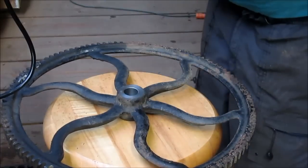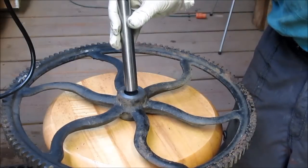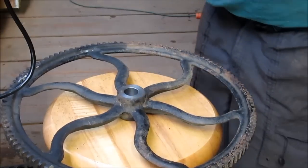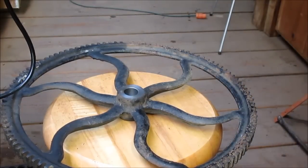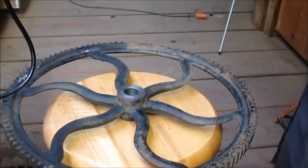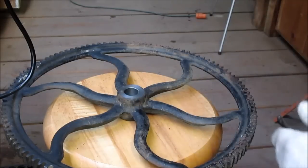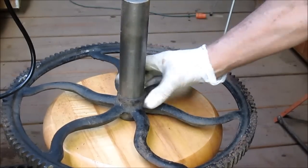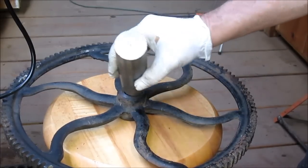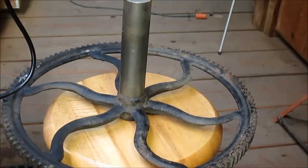Okay, we've got our surface cut. We've got our hole cut. And my one piece of tool stock is a little too small. Oh, well. But I always like to kind of work with the stuff I have laying around. Certainly this wheel is a case in point. I scrounged around, and I found this big old honking piece of steel. I hate to turn it down, but that's what it's for, and it is 8620, which is pretty good material for doing what I'm wanting to do here.